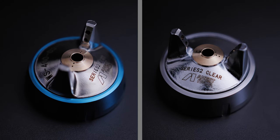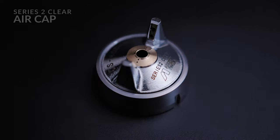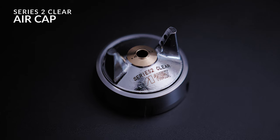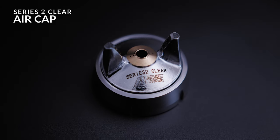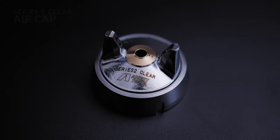In development we realized that when you're trying to get the air cap right for base coat, this would affect the performance of clear coats, and the same when you try to get clear coat right — this would affect base coat. So the decision was made to split them completely and separate them. Now, for example, for clear coat you have a specialized air cap for just clear coat.